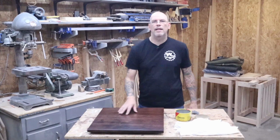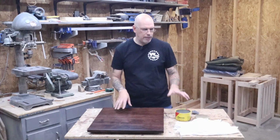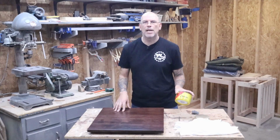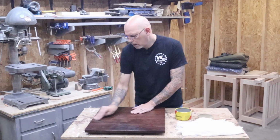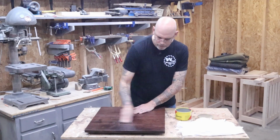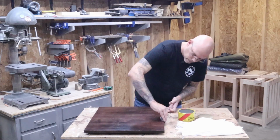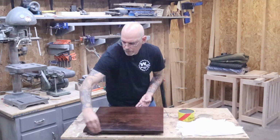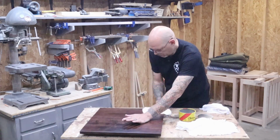Alright, these are all dry, they look nice. We're good to go. Now if you've seen any of my other videos, you know I like to finish it off with some Johnson's paste wax, some 4/0 steel wool, and a pile of rags. I'll just take the steel wool, dip it into Johnson's, and start smearing it around, trying to go with the grain. Then I'll wipe it off with a clean rag and buff it to a shine. It will definitely take your project to the next level.